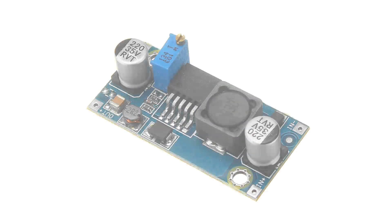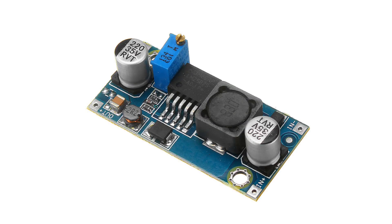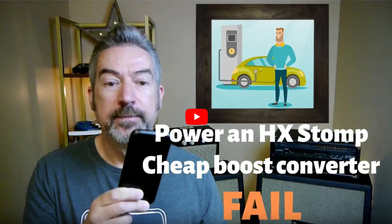Another way to change the voltage is to use an off-the-shelf DC-DC converter. These are available in various configurations from Amazon and eBay but I would not recommend using these as there are several potential issues. They're not usually designed for audio applications so they can be quite noisy. Converters are not hugely efficient and use power themselves just doing the conversion, so there's often not enough power left over to actually power the load. And the safety features are not always what they could be — they assume users have some experience. You could potentially damage an expensive pedal. I have a whole video documenting the issues with cheap boost converters and I'll link that below.